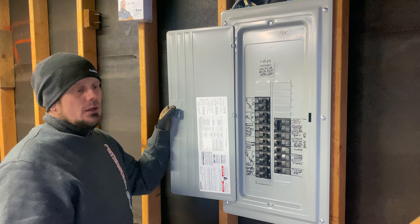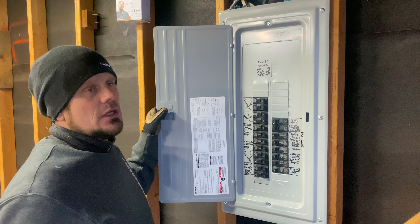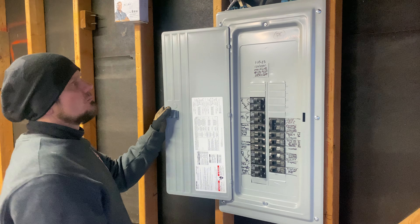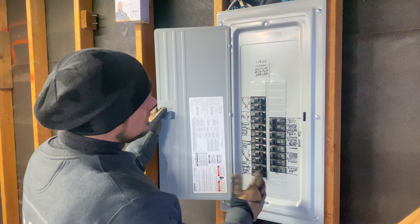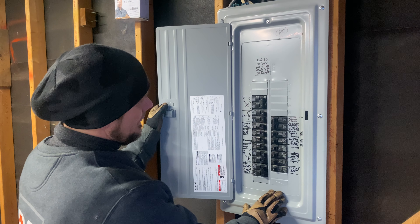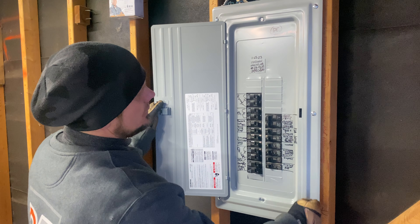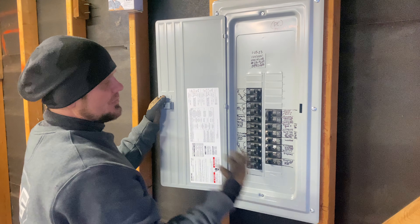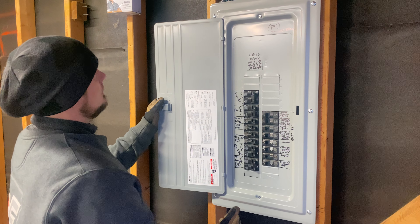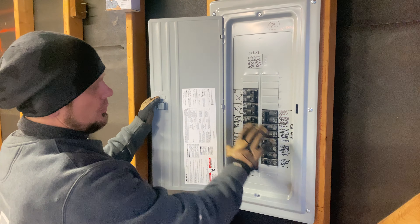That's a key factor. I've had some inspectors look for that, and Damien is the chief electrical inspector in Fort Collins — sharp guy. So I did pull a 1-ought in there for that 100 amp. All the breakers are labeled. We stickered everything, marked the side of the panel, and marked off as we went through. It helped us trace the house a lot faster. Then we took the old schedule and threw it away when we were done.